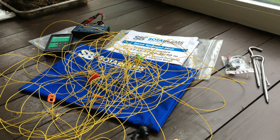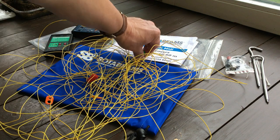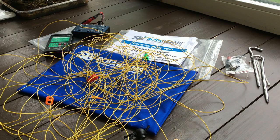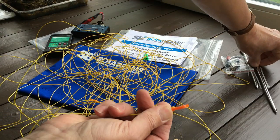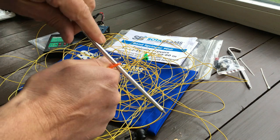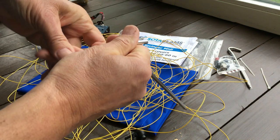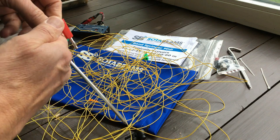You can use one as the radiator element and get it as high as possible — for instance, in a tree, or if you have a small portable mast, you can also use the mast. And the other one, the green one, just hang it out or lay it on the ground for the best radiation. And of course, this goes near my antenna tuner and just use the peg to secure it in the ground. Otherwise, if you're moving, you won't pull your transceiver off the table.